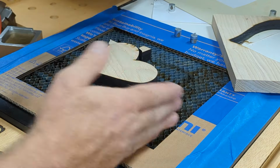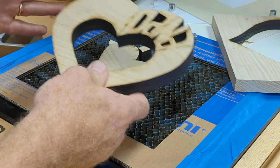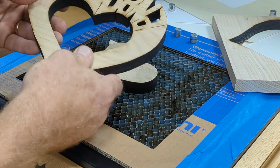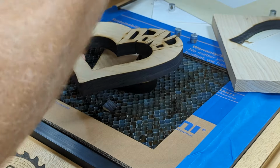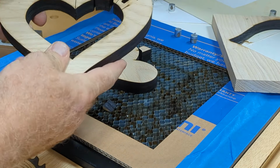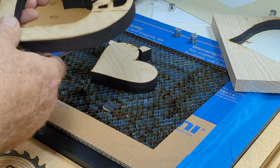So that reference on both sides with the frame that was in as part of the design, so that you're referring to pieces that are all within the same design page, really works well. It's basically the same idea as having dowel pins drilled in by your spindle and flipping over and sitting on those spindle holes, or the dowel holes. But that's a good way to get 3/4 of an inch with the laser really cleanly. This is a nice, perfectly straight cut. So I'm really happy with this.